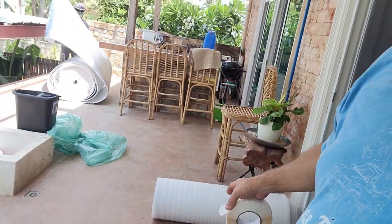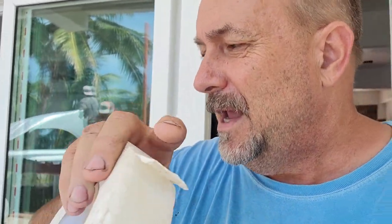Then when you roll out your insulation and you're holding it in place, you reach under, peel that white paper off, and stick that insulation down with this double back tape, and that way you've got it right in place the way you want it. And you don't have to do it on your other end. At your top end, you get your sheet down over that, and you can stretch that insulation up there, get all the wrinkles out of it, pull it in place, screw your sheet down, and it's locked in place.